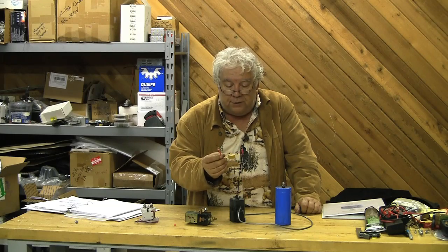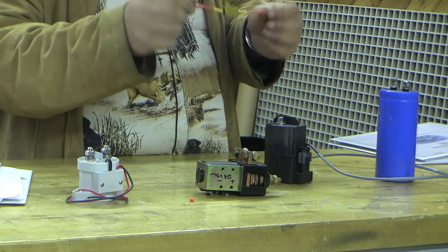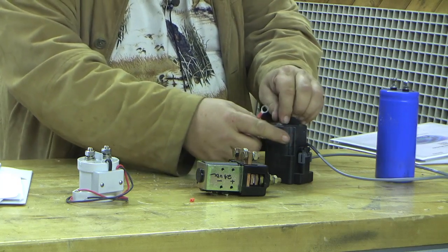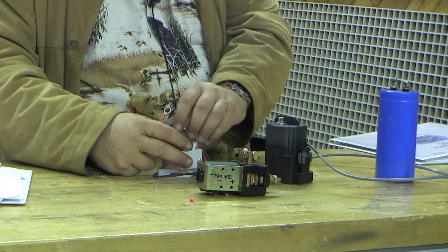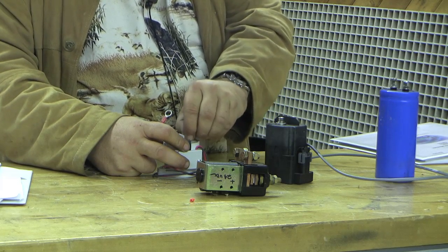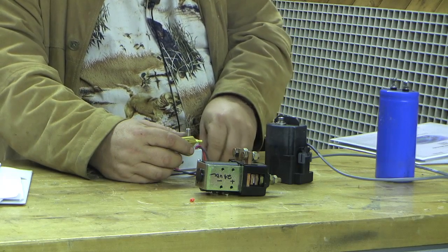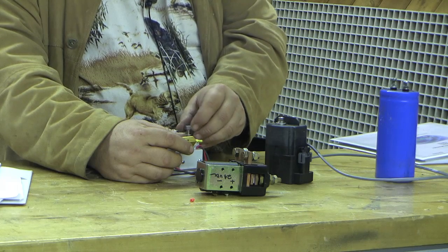If not, I'll very quickly see a puff of smoke. This is the resistor — I've soldered two little wires onto it with heat shrink over the connections and put terminals on it. I can take the nuts off one of these relays and simply connect the resistor across the two terminals, essentially shorting out the relay terminals — but the resistor, of course, isn't a short; it has a value of 500 ohms.